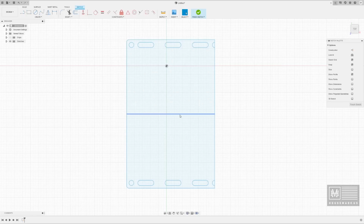We're not quite done yet because obviously we don't need that line, and these two lines are not intersected. So I'm going to go ahead and get rid of these. This is just a nitpick. You don't have to do this. I like my drawings to be nice and clean. So I create straight through lines so that when I pump it into SheetCam later, you'll understand what I'm doing. You'll see that it's important that if you want one cut, you have all the line segments intersected. So, all right, now we have half of the annealing plate already designed.